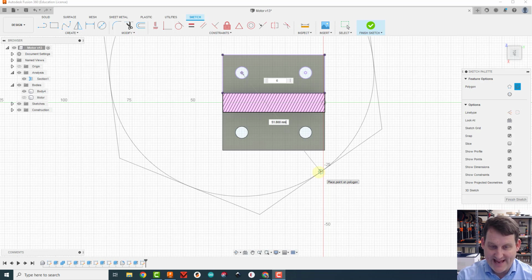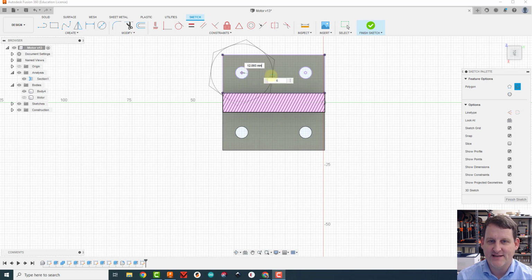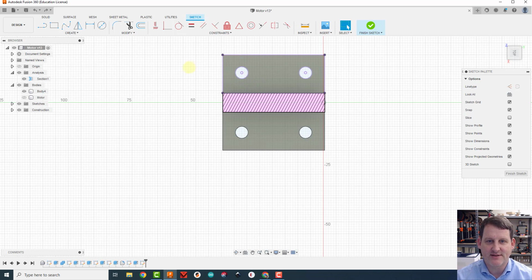Now I don't want to make it that exact same size because when the printer prints, it goos some plastic to the sides, it makes it smaller. So let's round that up to a nice even 9. So it went from 8.6 to 9. And then one thing to notice as well, if we type in 9 here, whoops, I'm going to Control Z, I just placed it without doing it.